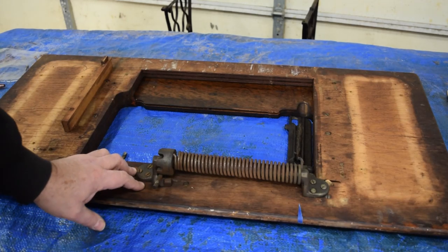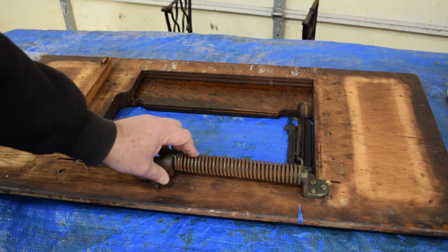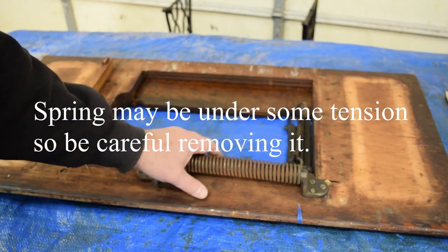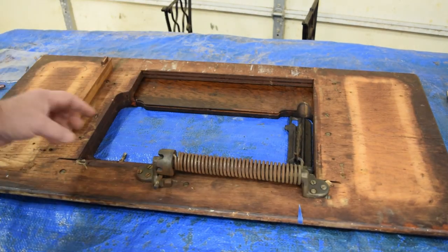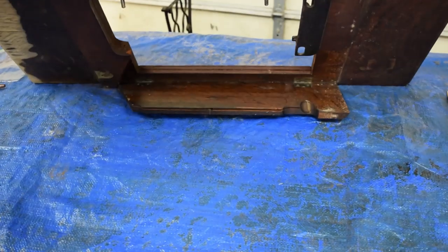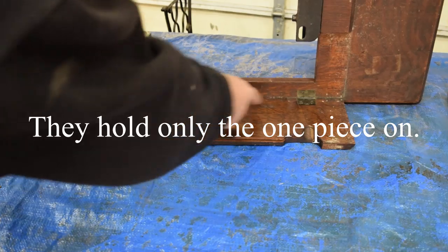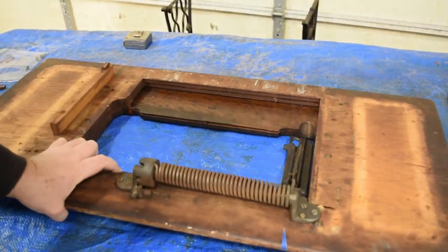And what remains on the table right now is this spring assembly, which supports the mechanism that lowers the machine and raises the machine. And then these screws here hold on this trim piece here and this trim piece here. So let's get those off and we'll be done disassembling the cabinet.